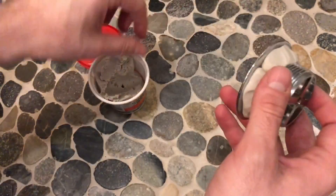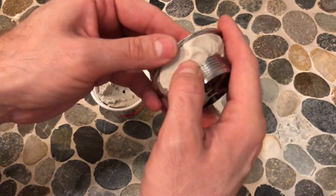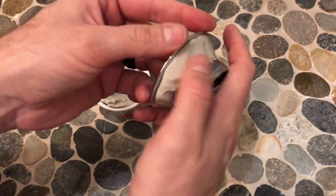Because of the curve on the bottom edge of the tub where the drain assembly goes in, I'm going to try using some plumber's putty to seal around the inside and seat the gasket on the back side. I'm not sure if that'll work 100%, but I'll try it as a first trial. Plumber's putty is generally something I'd use in a kitchen sink, not necessarily a tub drain. I want to get it into a snake shape — you don't need a ton of it because it's going to squish out, but you want enough to seat around the drain and get a solid seal around the bottom.